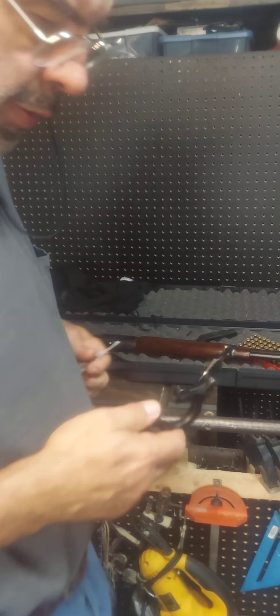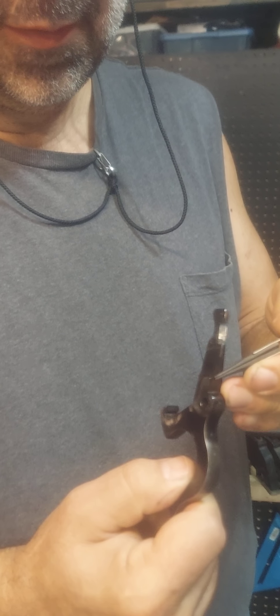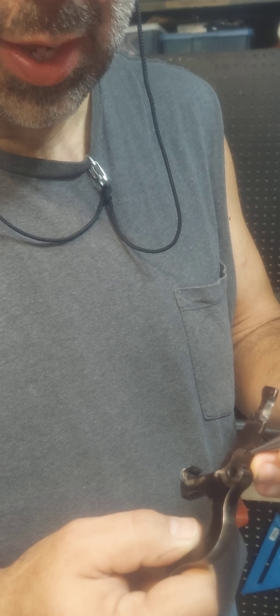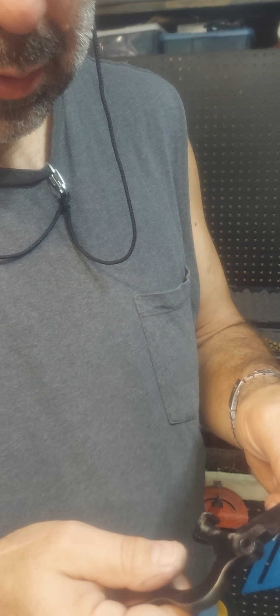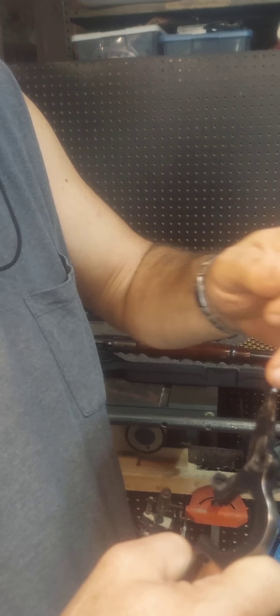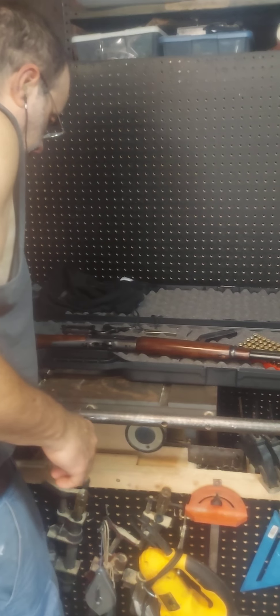This here is that little sharp edge - the radius on the thread where somebody said it tends to set down a bit. Probably like a 25 thousandths radius to get that sharp edge off, because that sharp edge kind of digs into the carrier. The carrier is just resting on this when it comes up, and then when this goes forward there's a piece on the carrier that the lever catches and makes the carrier flip up.